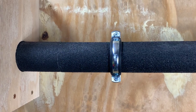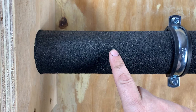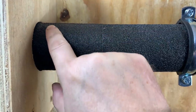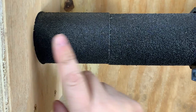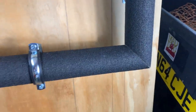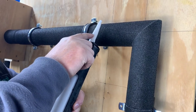So, sealing and bonding — first of all you'd always have a cut there on the wall side. As you see in the video, to seal this one up you'd pull it out, put some bonding seal around it, then put it back in and cap it, so you'd leave that as your first joint. Then you'd make all your other joints up, and then go back and start to seal and bond them. Try to cut the nozzle on the bonding seal as long as possible to keep it narrow.